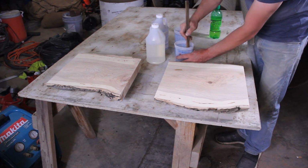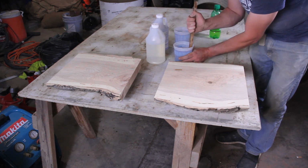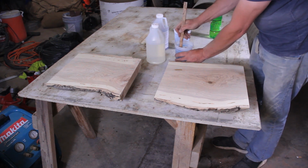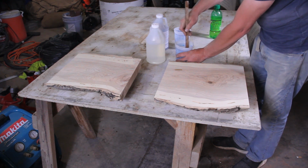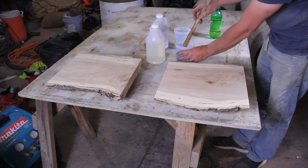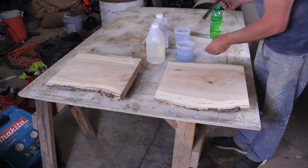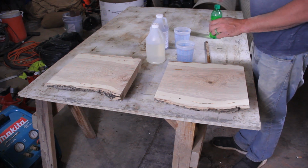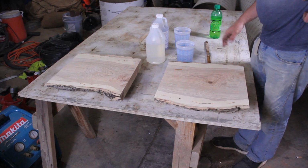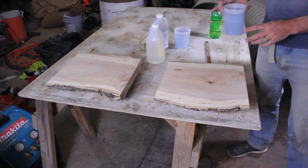Something with this resin in particular. You want to scrape your sides really, really well, and especially the bottom. And when you're pouring it, don't be scraping the edges of whatever you're mixing in. Pour out what you pour out and call that good. I had an incident. I did a penny floor for my bathroom in my old house, and scraped the jar, dumped it out, and ended up with a tacky spot about yay big that I had to sand out and re-pour on top of. So don't do that. Just stick with what you've got.